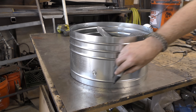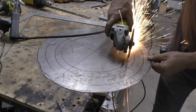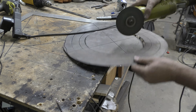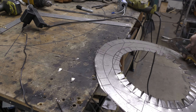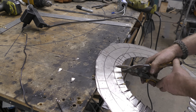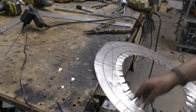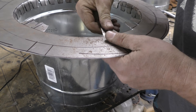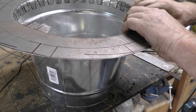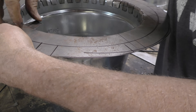The fan diameter was 15 inches, so I needed to reduce the opening to 12 inches to attach the first reducer. Cutting the tabs allows for a better fit between the fan and the first reducer. Once I pushed all of those tabs down, I went ahead and added a few self-tapping screws to hold it in place.